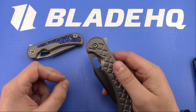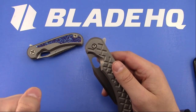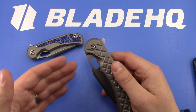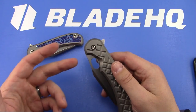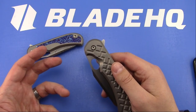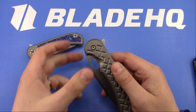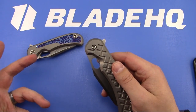And so when you preform that track, the titanium will not compress further, and so it's not necessary to go in and put in a stainless steel track or racer. But, you know, again, that's a lot of hand work by preforming, you know, cold, the bearing track in the titanium. So if you don't do that, in theory, the titanium could compress on its own over time. And if the design was designed in mind that you'd have to tighten it, which I don't really know that there's a good way to do that, it should be fine, but in reality, it's probably not.